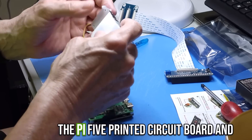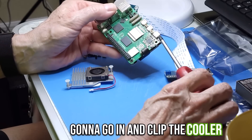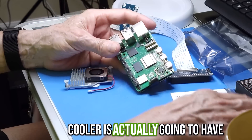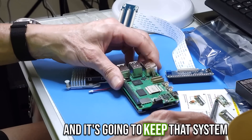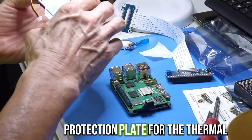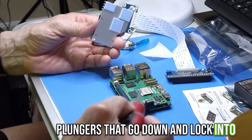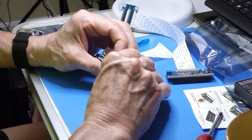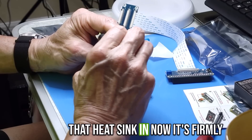For an $80 board, it's pretty amazing. There are two holes on the Pi 5 printed circuit board where the plastic clips from the cooler lock in. You've got three major chips on that board, and the cooler has thermal pads that connect to all three to keep the system cool — don't run it without the cooler. I'm taking off the protection plate for the thermal pads, and there are two plastic plungers that go down and lock into the board to hold the CPU cooler in place.